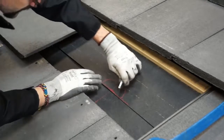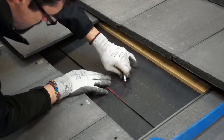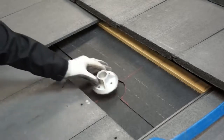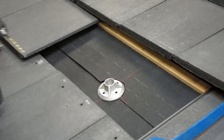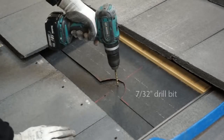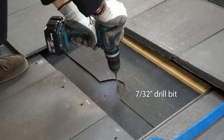Cut out the outline with a utility knife, being careful not to cut the felt in the layer below. These felt paper overlaps are typically in 3-foot intervals, but if there's no overlapping felt at your desired location, we'll show you alternative waterproofing methods further into this video. Again, using the mount as a template, mark two penetration points using a pencil or light drilling. Remove the mount and use the 7/32-inch drill bit to make your penetrations all the way into the rafter.